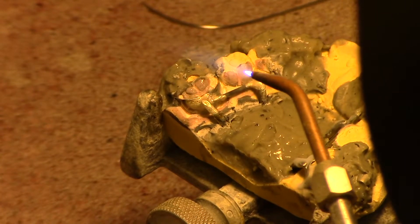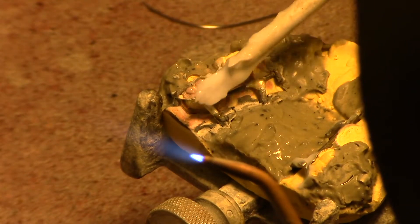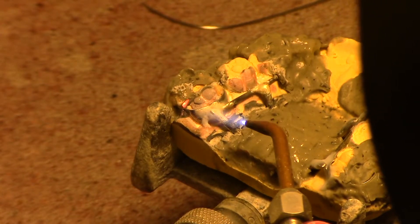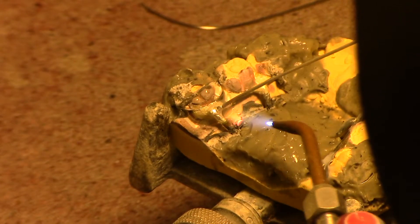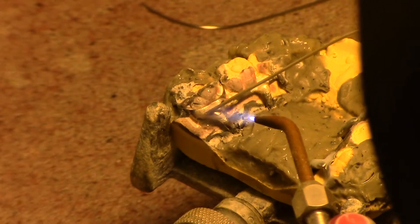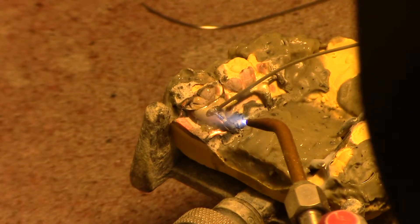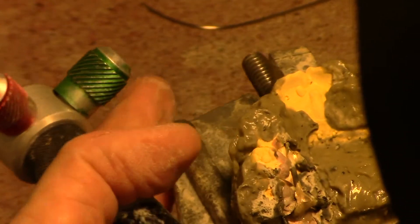We've got a good diffusion zone built up there. If you're a beginner you'll probably want to reflux — I like to reflux anyway just to make sure — then I'm going to add the bulk to the solder joint. This has a big wire sticking out so I want to add quite a bit of solder and keep it all in that gelatinous zone, right above — just barely above — that liquidus, the low end of the liquidus zone. There we go — completely covered, the end of the wire is covered. That should polish out and look very nice.